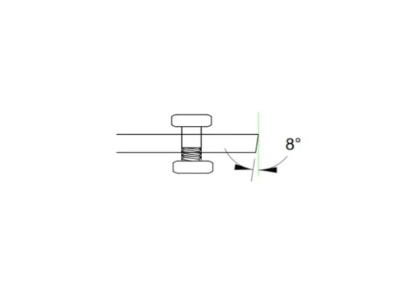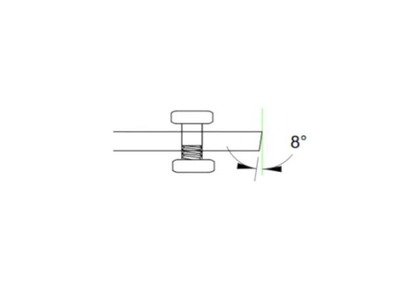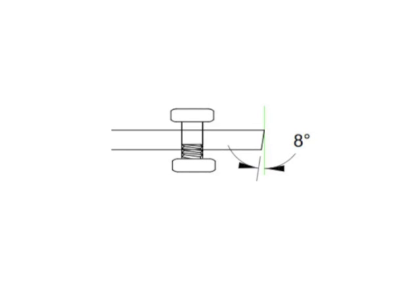The picture you're looking at right here is the blade with the pivot through it, and at the bottom of the blade you can see there's an eight degree angle ground into the blade. This is so that when the liner springs over, it springs over and locks the blade. We're going to do this very carefully — it's easy to grind too much off, and then you have to make another blade or another liner. So we're going to do this very carefully at first fitting, just where it's barely starting to lock up, and then we'll fit the rest of it later after the detent is added.